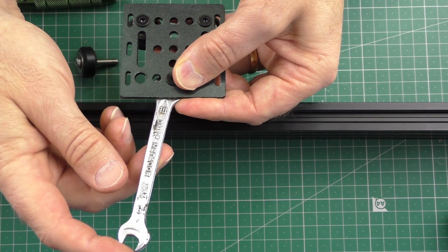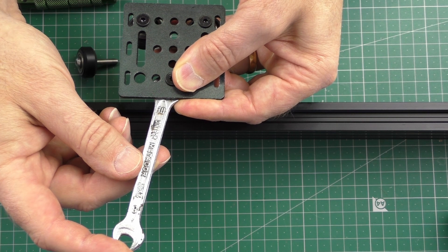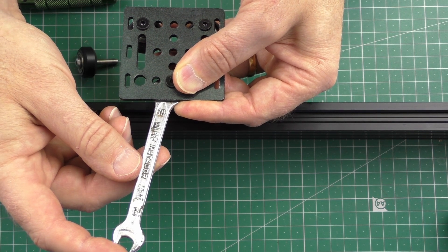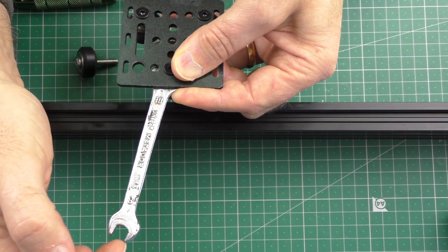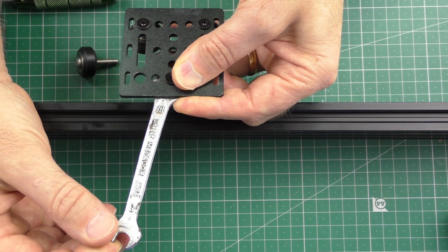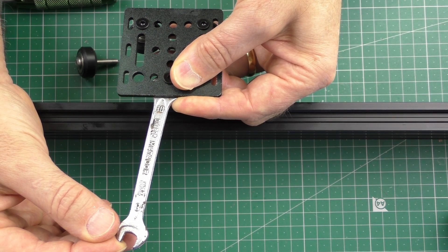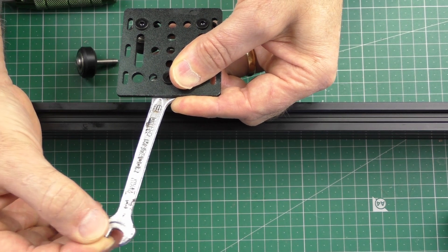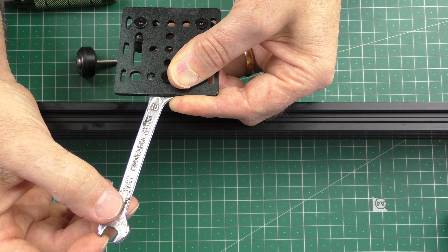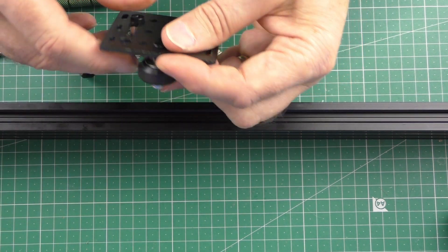It's a very, very gradual adjustment. If you can see my spanner — I'm going to adjust the nut as if this was on my printer. Did you see it? I actually moved that spanner and I hardly moved it at all. That last movement was too much. It's just gentle — if you're doing this much, that's too much. You want to do little bits at a time.